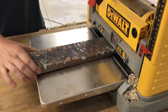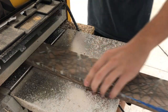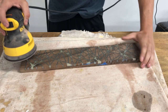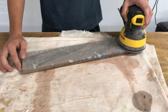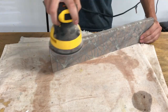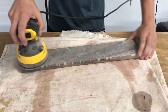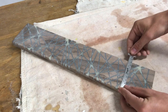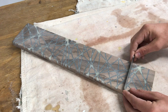Epoxy will run through a planer just fine. Make sure you've got sharp blades and take your time to make light passes. Be sure to wear a respirator too when cutting epoxy — I'll leave a link to one in the description. Then on to sanding; I used 120 grit, which will be best to soak up the finish later. Since this was scrap wood and I really didn't have a dimension in mind, I just used my pocket rule to make the coasters square.